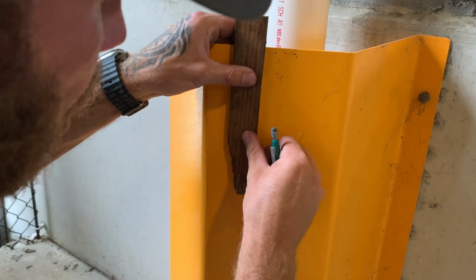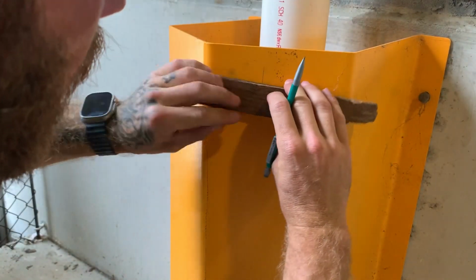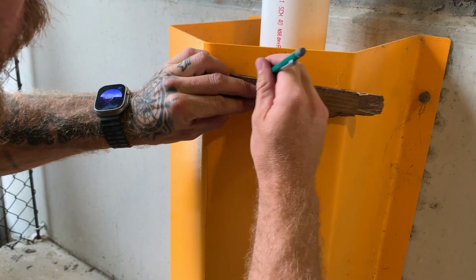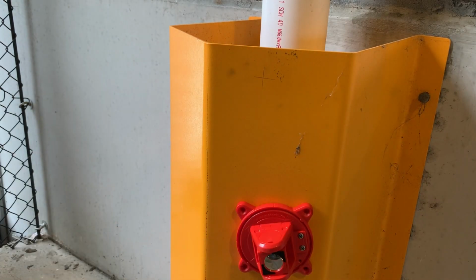The suction cups do work on almost all metal surfaces as well, in my experience, but with the suction cups, when I do remove them, I cannot come back later to that point as there isn't a demarcated center point left behind. So what I did was I super glued some extremely strong rare earth magnets to some of the stainless steel discs and used those in the same way as the magnetic pots.